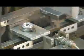Many components are made of powdered metal — mostly iron powder mixed with some graphite and copper. After a press compacts the powder in a die, a furnace fuses the particles. This powdered metal part is the valve, through which the piston forces the oil.